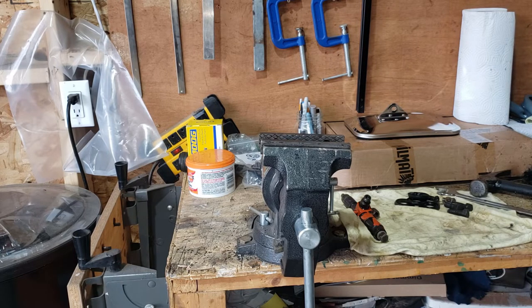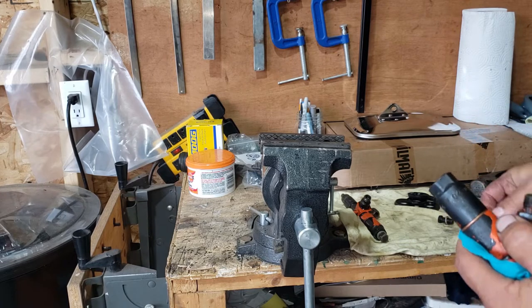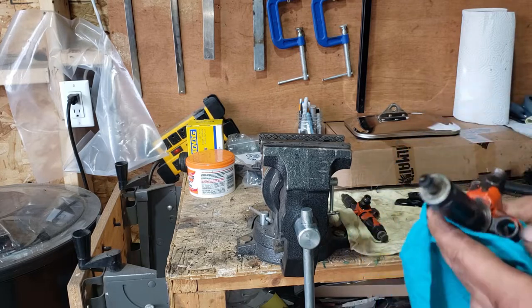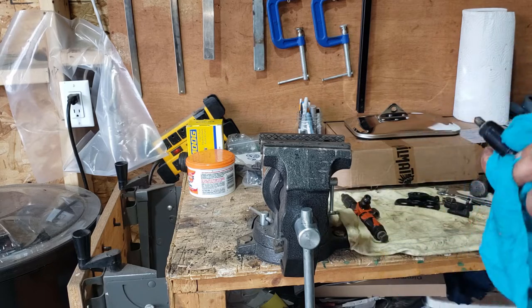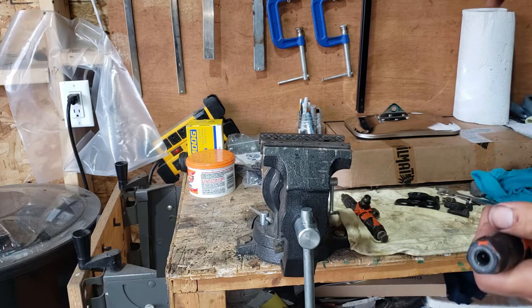I pop tested these injectors probably a few months ago. The opening pressure that these injectors were set to was considerably lower than what this tractor requires. I think these were opening around 2,000, 2,200 PSI, and I think that's normal for most older tractors. So I think it was serviced by someone at some point who worked on older tractors, but this one apparently needs about 3,100,